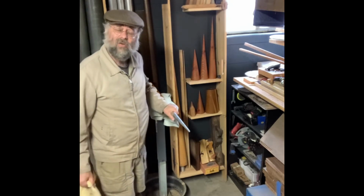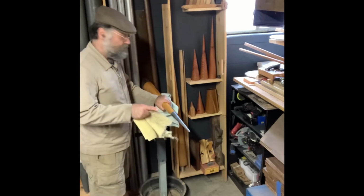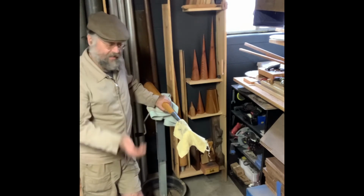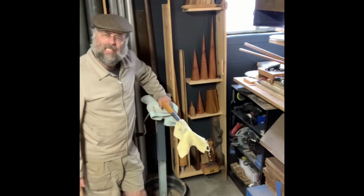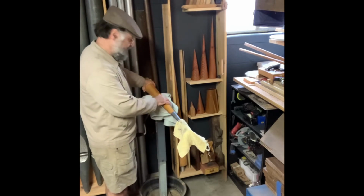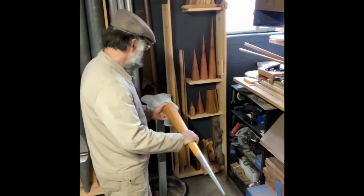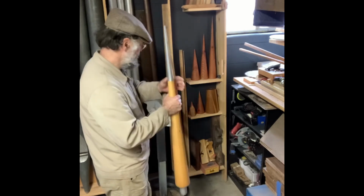If you walk away, be that with a pointy mandrel as this one here, or a straight mandrel, be nice to yourself and to your fellow neighbor and worker. Put a rag at the end so that nobody by accident just walks in and impales themselves. All the guts are spilling out. All that cleaning up, unnecessary. Let's not do that. Okay? And if you want to use the back end of the mandrel here, you're simply going to put a stubby mandrel pipe in here, and with this cool ending, stick it into here. Bingo! Okay? That's the plan. That's how we're going to do it.